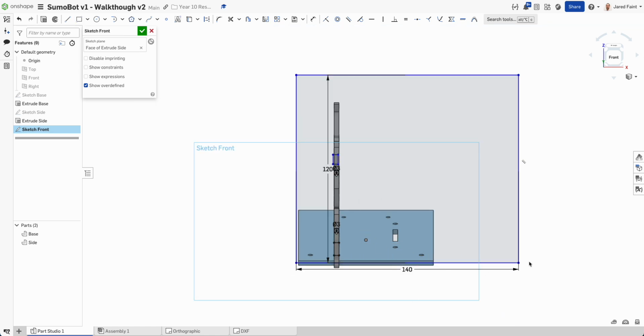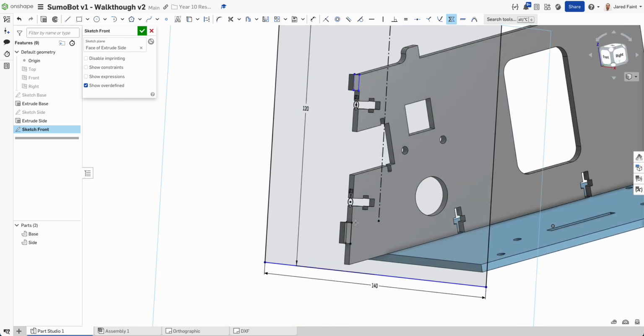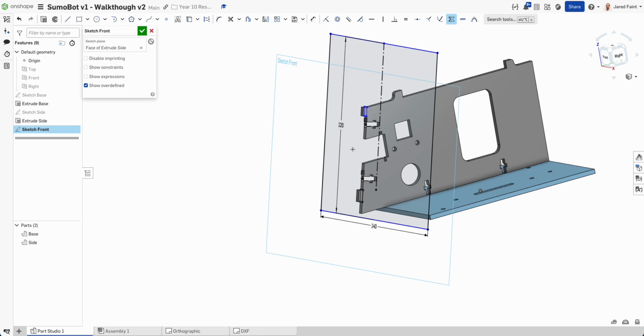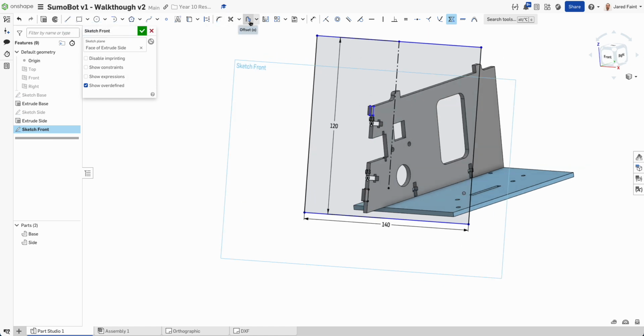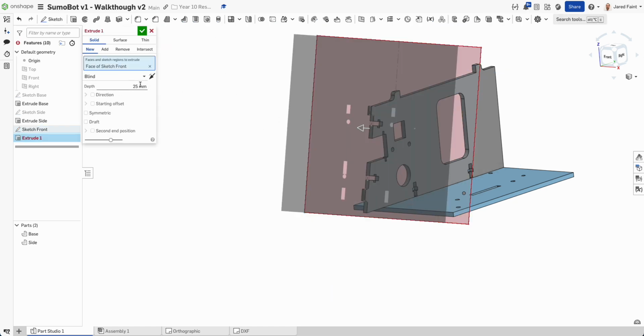Okay, and then from here, let's get a center reference, which is there. Make that a Q. So now I've got a, where is it? Symmetric, that side to there. And what we probably want to do is I'm going to mirror those cuts and then go back to our assembly and see how that looks. So Shift E, add that, that's 3 millimeters as a new piece. Beautiful.